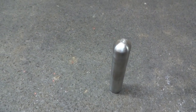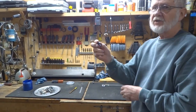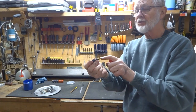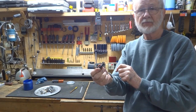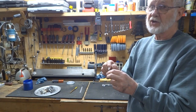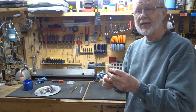We're going to use this new punch instead of the old one and see how it works. We'll take a bolt — a 3/8 Allen head bolt — and put a spring and a ball in the end, then use the punch to keep the ball from coming out. Our ball is 0.1875 inches, or 3/16, so we want to drill a hole a little bigger than the ball. We use a number 12 drill, which is 0.189 — a couple thousandths bigger.